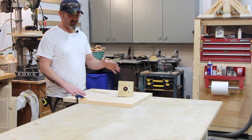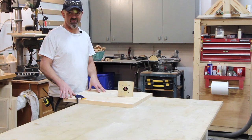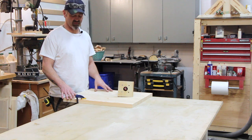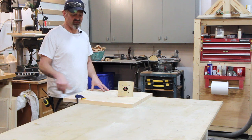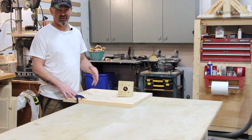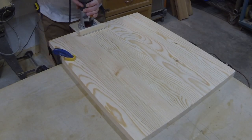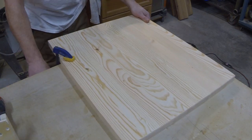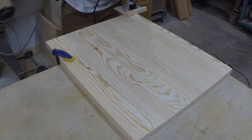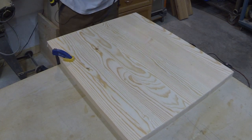The only thing I like to do is start with my end grains — chamfer those first, just to reduce the chance of tear-out. If I do get a little bit of tear-out, the chamfer on the other side is going to pretty much mitigate it with the round-over cut itself, so there's not a lot of clean-up or repair needed.